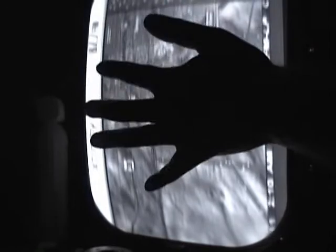Something else I've noticed that's kind of annoying is that if you adjust the focus, the picture's clear in the center and on the left, but it's blurry on the right. It's a little blurry there. Might have to do with the yoke or the focus coil. I might have to physically adjust them a little bit. But anyway, the retrace lines are gone. Cool.